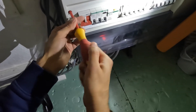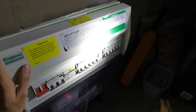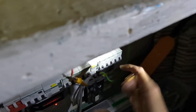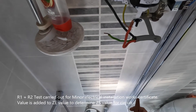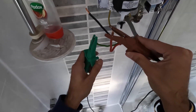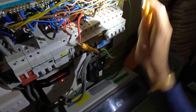Make sure all the power is off before you remove the lid — you can't remove the lid without the power being turned off. I'm linking my crocodile clips: the live wire to the earthing terminal. I want to check and measure the continuity between the two to make sure there's continuous earth protection to the unit. We're checking the resistance between the line and CPC — the earth wire — and it's reading 0.3 ohms.